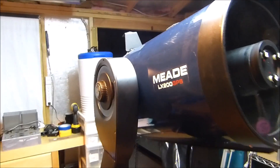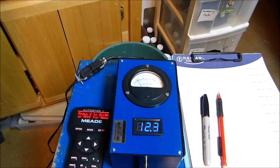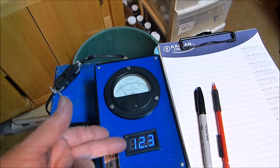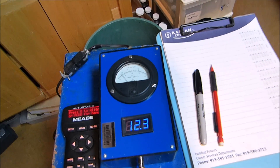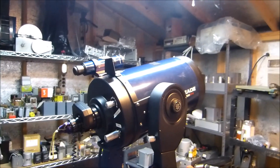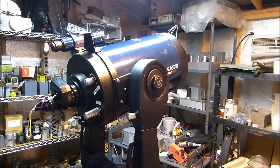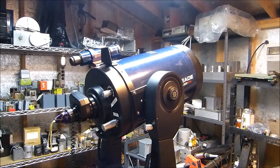I hope this helps, and especially it's going to help me because now I'm going to know exactly how much current and voltage I've got all the time. Build yourself one of these — it's just a box with a wire in it that goes through the current meter and a wire out, and the voltage meter is just across the output. Make sure you know how accurate your meter is — in my case it's 200 millivolts slow. So there you go. Thanks for watching. I really enjoy this, I hope you guys and ladies do too. Good seeing, good viewing, have a lot of fun, stay safe. And again, thanks for watching — I always learn from the comments and the discussions we have.